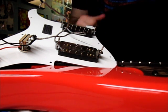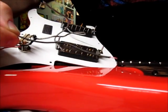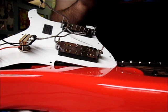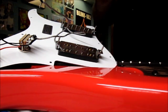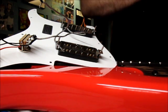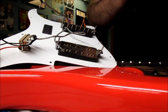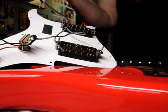I've got my extra ground wire here — maybe three or four inches long — and I've just stripped both ends of the outer coating. Make sure you use stranded wire. I'm pretty sure it's 22-gauge that you want for guitar wiring — that's what's used mostly.